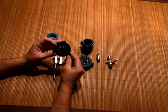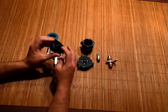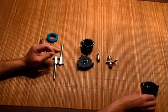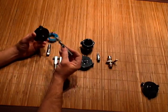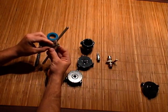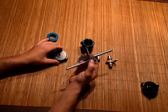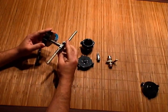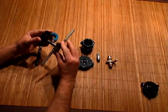Take one of your coupling caps and you're going to want to grind down the nub — the post, where typically there's a chain — get that flat with the face of the coupling. You can do that on a grinding wheel. Get it nice and flat, then drill it out with your 7/16-inch bit to create that center hole. Once the center hole is drilled out, that's where your tap comes into play. Put it in a vise, get it nice and level, and start your tap. If you've never tapped a hole before, it takes a little while — use some machine oil, do a couple turns, back it off, do a couple more turns, make sure everything's level.